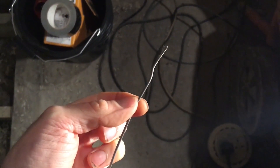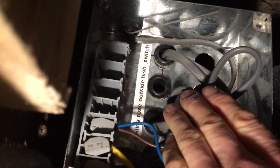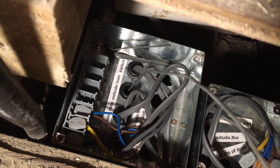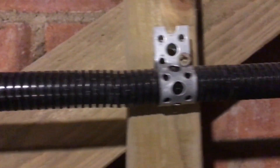I'm not sure what's going in some of these routes, so rather than putting the cables in now I've left them empty. I've been using this galvanized wire for pulling the electrical flex through the conduit. I found that if you leave nice smooth curves at the corners when you're threading the conduit around the frame, then the galvanized wire can be pushed along the whole route. Back down at my junction box I've got it set up like a little manifold with all the conduit leaving the underside of the box, which makes it easy to thread the galvanized wire in any time I want to pull a new cable through. So I just fix the empty runs in place, check the galvanized pulling wire goes all the way down the route, and then I know it's ready to be encased in hempcrete.